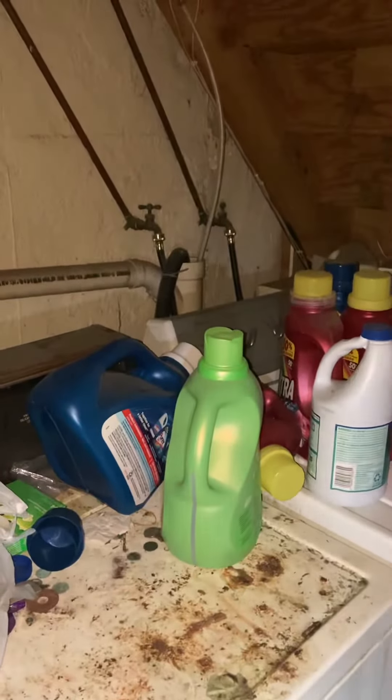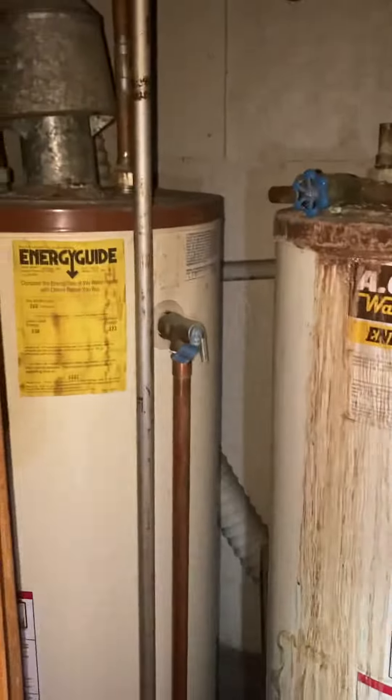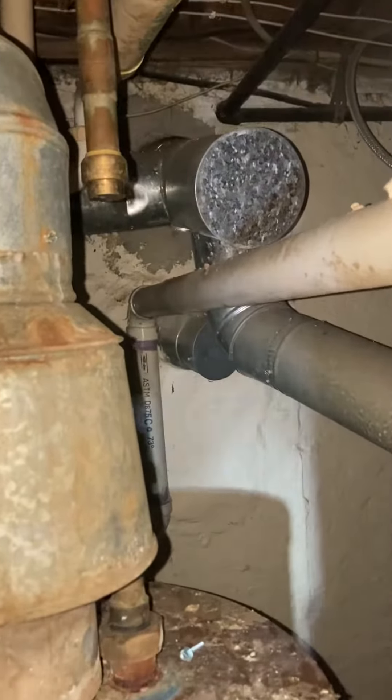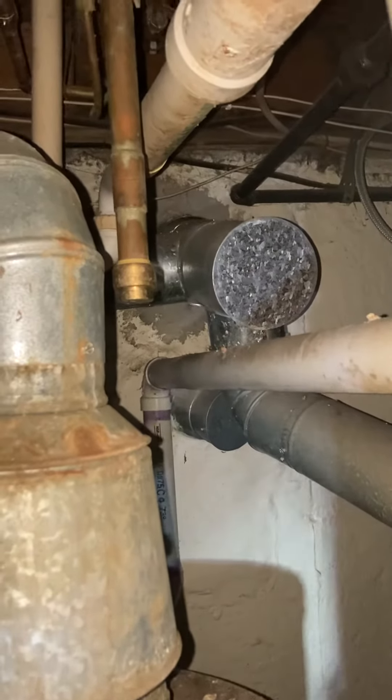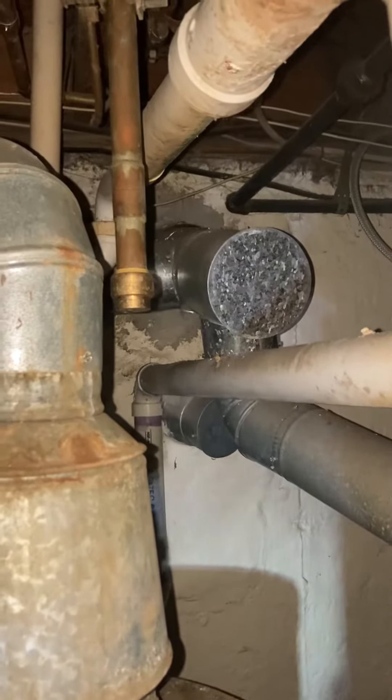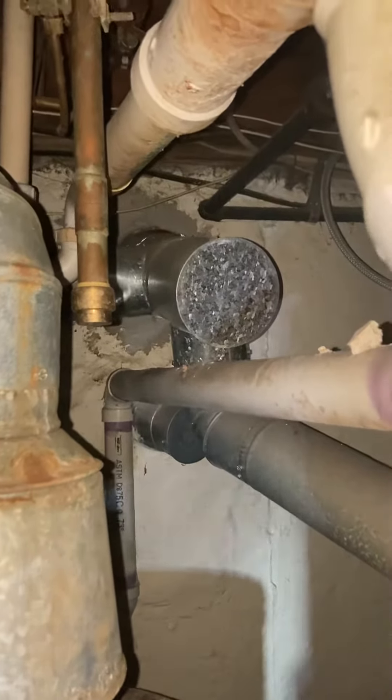You can see the condensate pump that Vince put in this summer. The drain is just over here to the side — the reason I'm mentioning the drain is we're going to be installing a water heater as well. Right now there are two water heaters; one is not functioning. We want to take them both out and connect into the existing flue coming down. On that swivel tee it'll be a 5-4-3 swivel tee, and we need a five-inch clean-out cap on the bottom. We've got pretty good height.